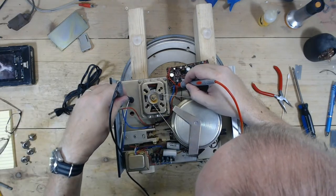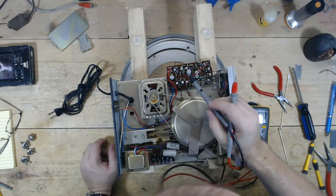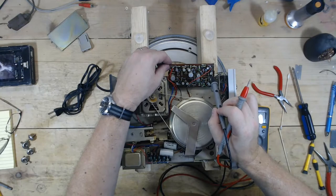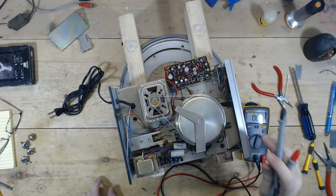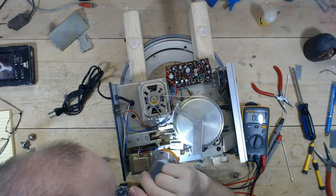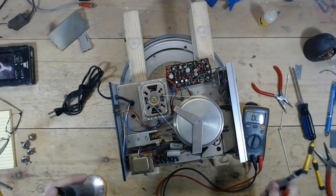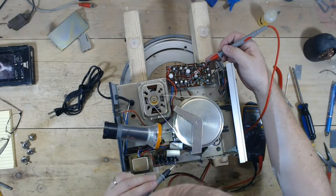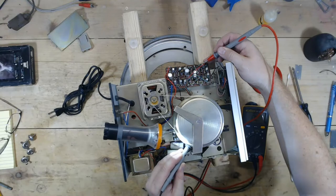Alright, blue to blue — that's good. I might see if there's even a schematic on this. Failing capacitors can cause a channel outage. This is a super simple board — we have red and green, and I assume those go to the heads, and it looks like they do. I'm going to shine a light underneath to make sure no wires have come off the heads. They have not. I want to check white to white on the red cable — that's good.